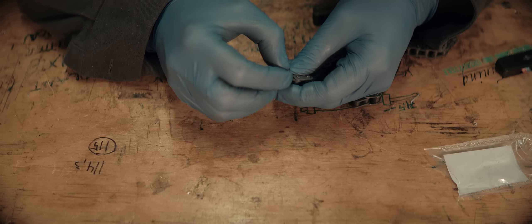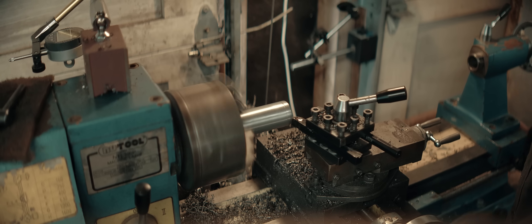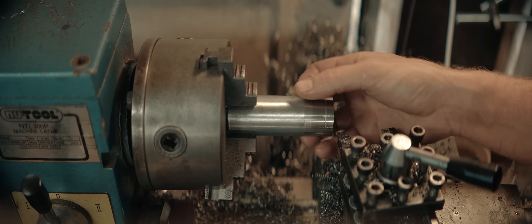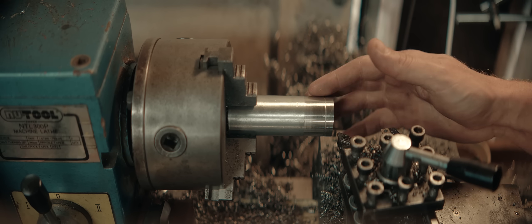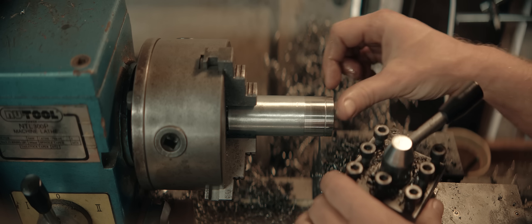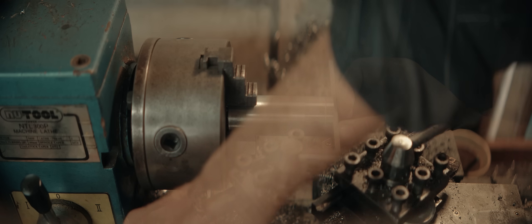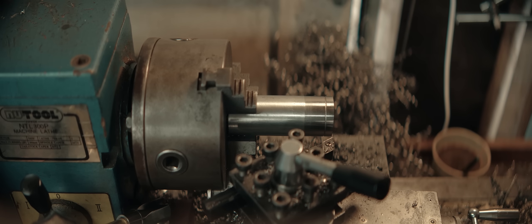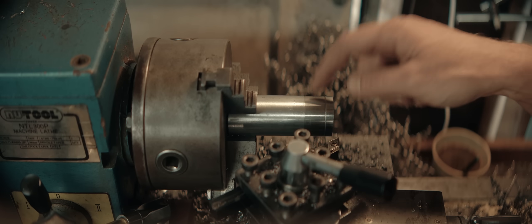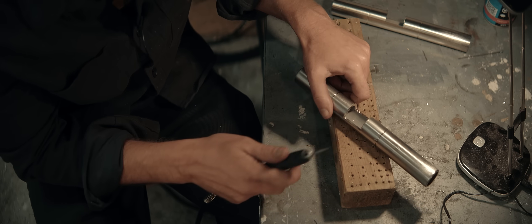Let's move. I haven't got a parting tool — well, actually I made a short one from HSS but I left it at my friend's yesterday. I can't be bothered grinding a new one for just these two washers. I think squaring the edge of this tool to the end of the stock and using that as a makeshift parting tool should work. Maybe. There won't be enough clearance — I'll see if I can switch the tool around and come up with something. Worst case scenario I'll just use the hacksaw or angle grinder. Before making washers I'll have to deburr the exhaust tubes, fit them up and see how thick those washers ended up needing to be.